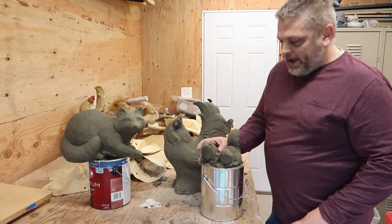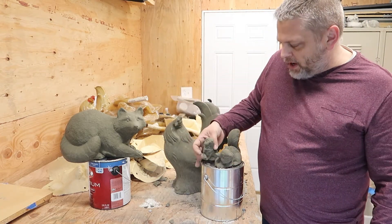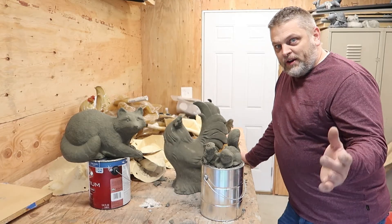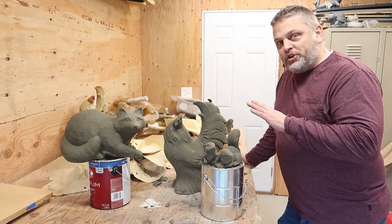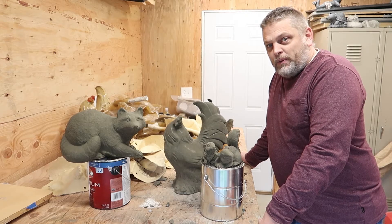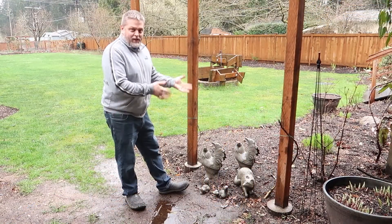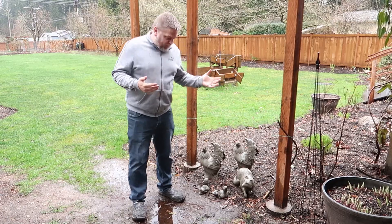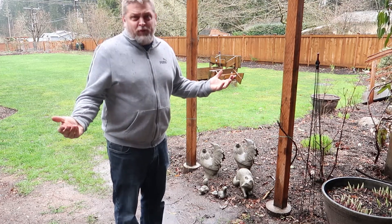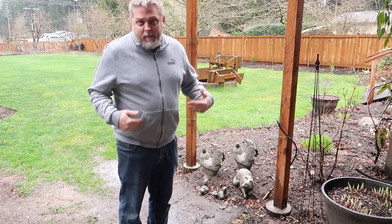The molds are taken apart. I had a little bit of extra concrete, so I kicked out one of my old molds — I had a tiny bunny and went ahead and got that made up too. That's a success. You can see in the video these are very dark gray right now. If you're not familiar with concrete, in that first day — even the first week or so — it's going to look like this, and then it's going to turn super light gray as it dries. It really needs at least a week to harden up. I actually had time to make an extra chicken and squirrel, so there's now a twin set.